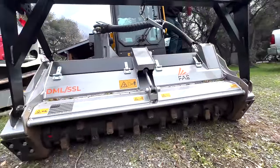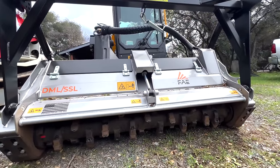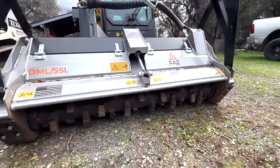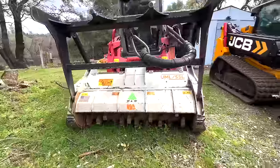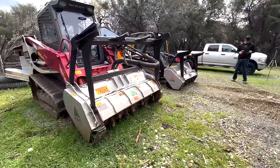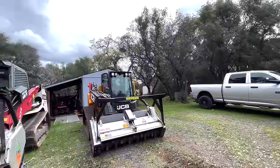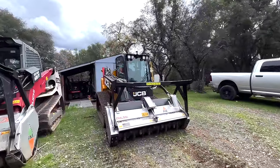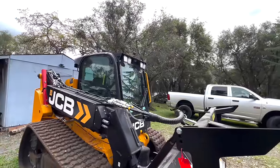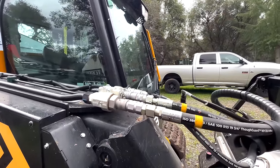Let me show the difference in the drum. It's basically the same style just on a smaller scale. The drum isn't as wide, so that allows it to rev back up quicker, but it's got dual-point carbides — just a little bit smaller than this one here. I think the head width is about the same. Nothing's cheap, so you can't really get around that. Everything's expensive. But for the versatility with this thing — when you do mulch, I think this head actually kicks some serious ass. I wanted to do the telescoping thing, but you can't with high flow.